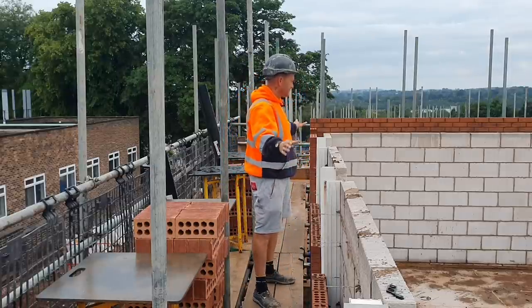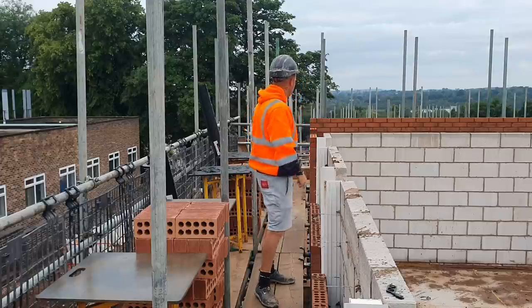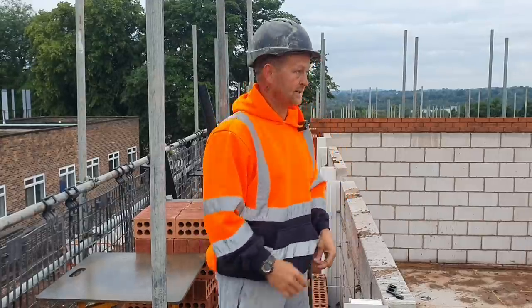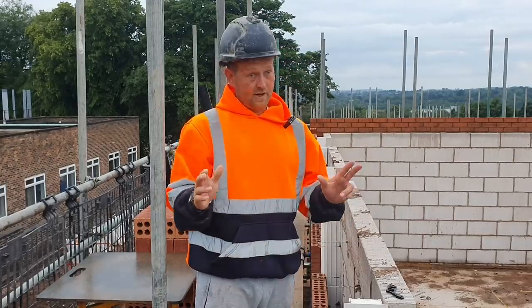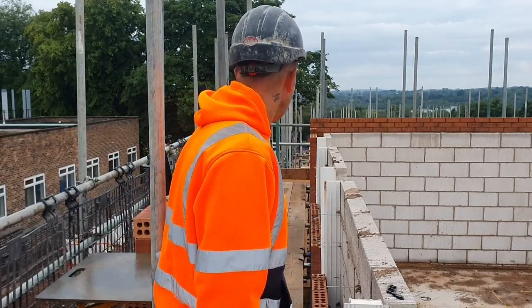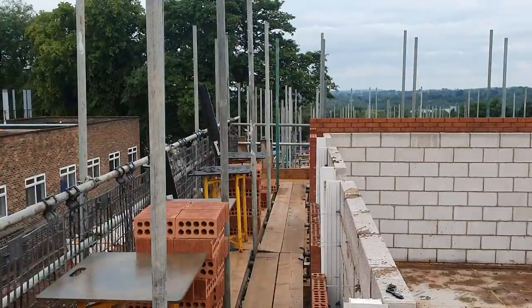Get this brickwork in. Lintels on, run the course straight the whole way through on the front, run the course through on the back, and the brick and the wall plates. Hopefully we can get that done before 9 o'clock. It's 7:15 now, so let's get some mortar out. Mortar doesn't look too bad. Oh God, there's like an inch of water in each one of these buckets. I'll put that straight back into my wash bucket because I know we need water today.